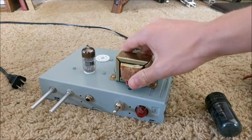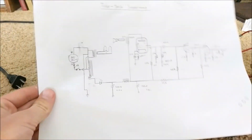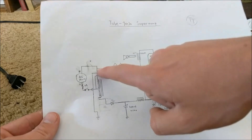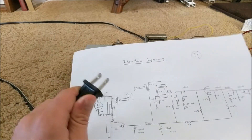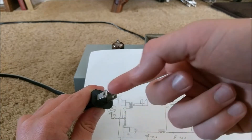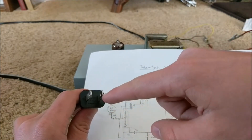So in this design I made some drastic changes to the power supply. In my new tube amplifier I have grounded the neutral wire of the AC power line. I have also made sure to use a polarized plug, because the wide spade is known as neutral and the small one is known as hot.